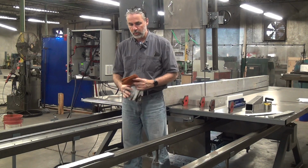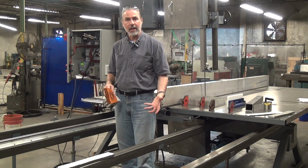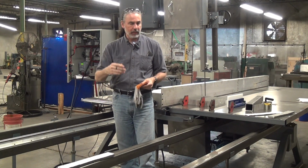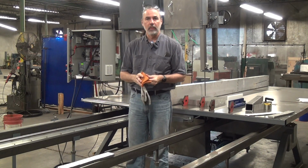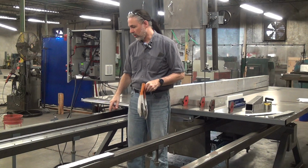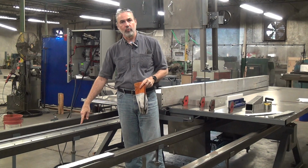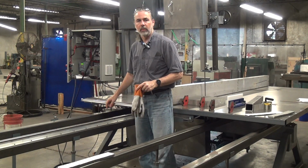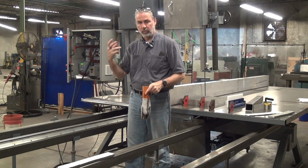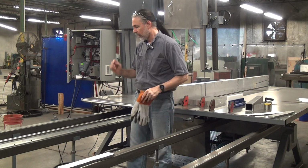Most of our traveling tables use these 3-inch square tubes as the supporting and guiding elements. We basically have bearings that run alongside of them. It gives a pretty good ride, usually good to something like an 1/8 or 1/16 of an inch over 3 to 6 feet. This machine, however, the customer wanted a little bit greater precision than that. So what we call the guide rail is precision linear round rail, and this part of the table is running on recirculating ball bearing support bearings. Very smooth, very precise, very expensive.